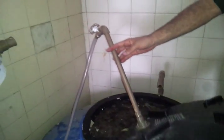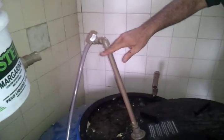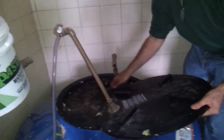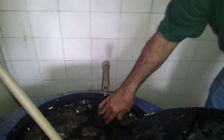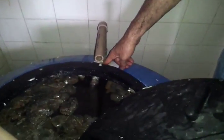The gas outlet is right at the very top, and the gas tube is higher than the water displacement bucket — that's necessary so you don't have overflow. There is a tube here which has an elbow going down to about the center of the tank. This tube goes down to the center, and this is the fertilizer output that comes out of the hole that was already in the tank.